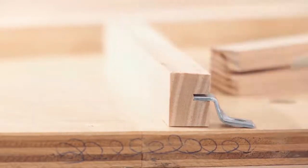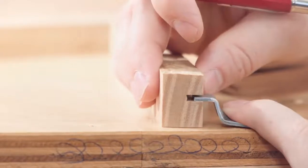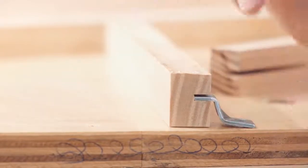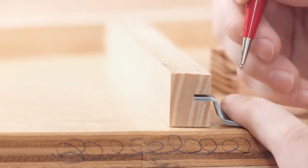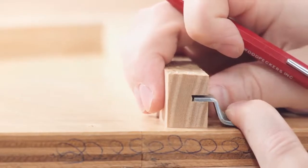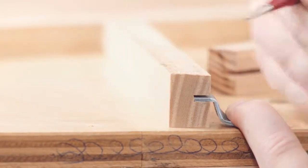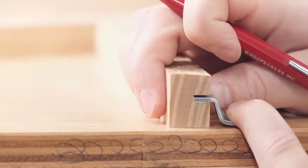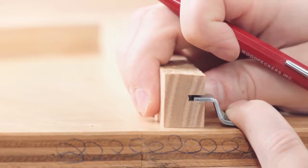That way, the bottom of the clip is now parallel with this, and it will allow the tabletop to expand and contract while at the same time having a nice size gap down here for the screw to pin everything in place. So as it's nice and tight, pinned in place, it's not gonna move around, but the seasonal expansion and contraction, that type of movement, it's gonna have less friction and allow this to, well, expand and contract